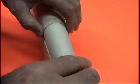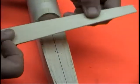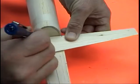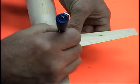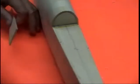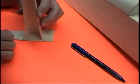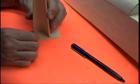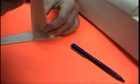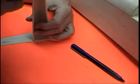When that butts up there, I need to know the total width so that these two, where my fingers are right now, marry up. So what I need to do is just take a piece of scrap wood, find out the total length, total width. And once I know the total width, then I can take this piece, lay it on here, and it needs to get spread just a little bit, and I can trace out that inside curve. This is one of the little tricky things that has to happen.